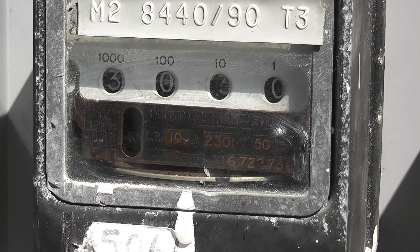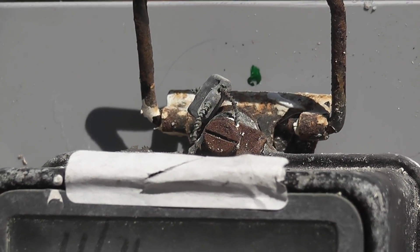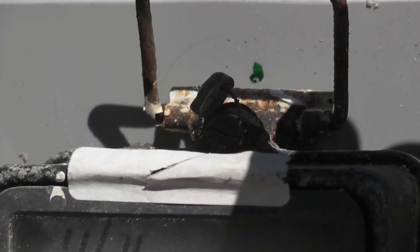The Ferranti meter has quite a dark disk. It looks like varnish on it, so the meter has been subjected to high loads. It may have fried up a bit. Definitely some varnish there. Also the original meter seal is still intact.